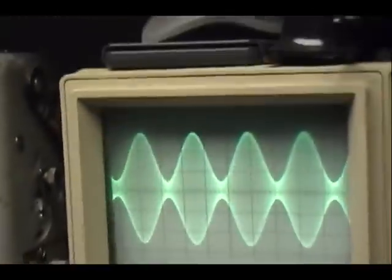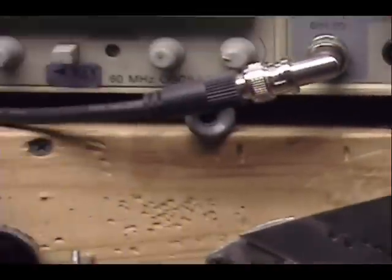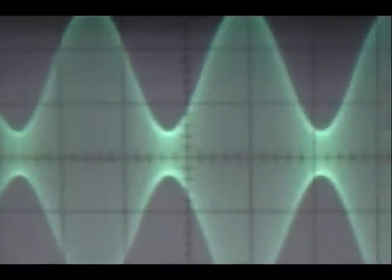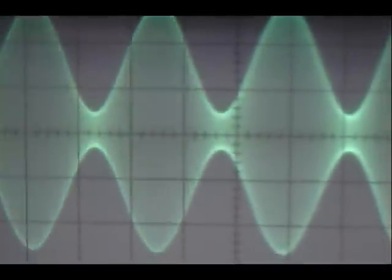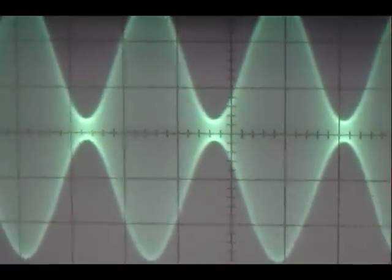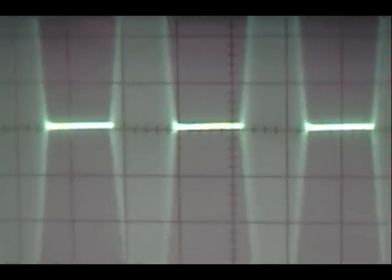Alright, now we're going to put a test tone to this because we didn't do that previously. This is the OEM test tone out of there. Alright. Customer wants that test tone to not exceed 100%. See that valley right there? Readjust that so it comes down right there at 100%. So this has gone past when those become bright lines right there, and that's severely too far. He wants to make sure that we keep it way down.